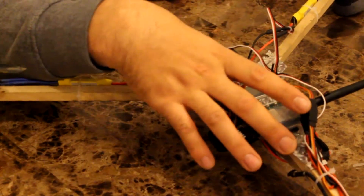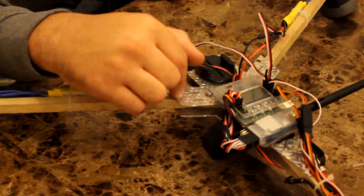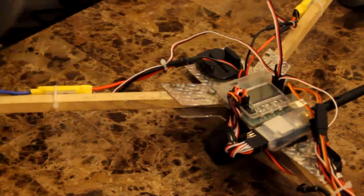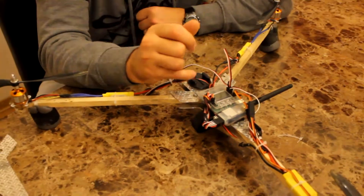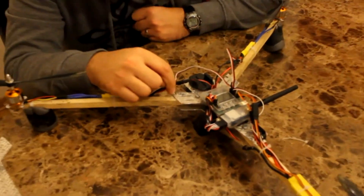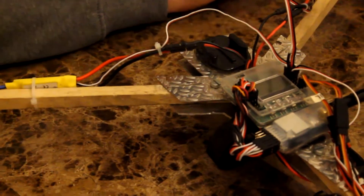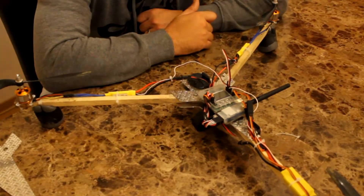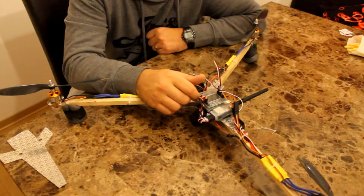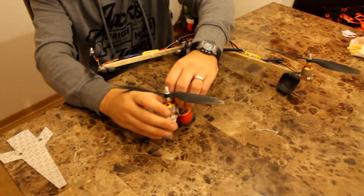This carriage here that's holding it all together — the main body — is actually made out of aluminum. It has a diamond-type plate design and I cut all that out with a Dremel tool. I also made small notches in the sides so you can take zip ties and route them around the boom so it can break free or fold. You can put it in your backpack and go for a hike, or video record your kid's sleigh riding, whatever you want to do with it. I also have a 9-gram servo for the back.